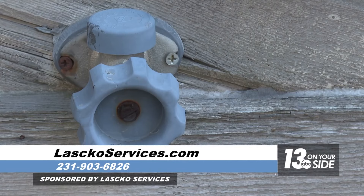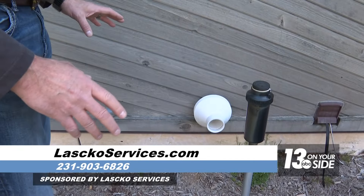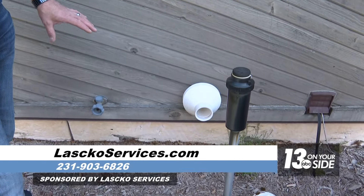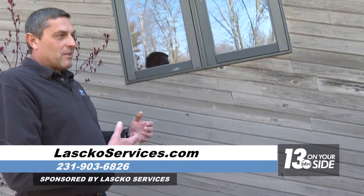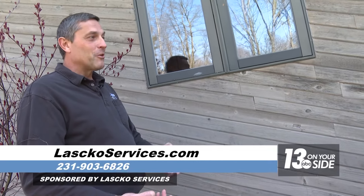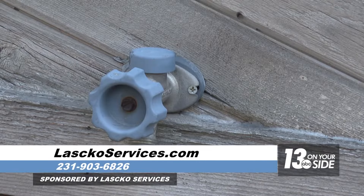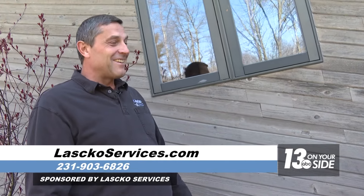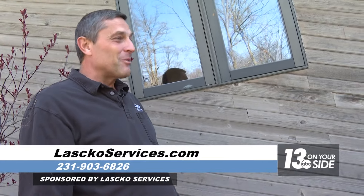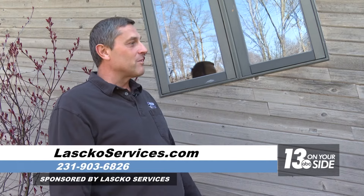The last thing is outside faucets. When you first turn one on in the spring, let it run for five to ten minutes, then go inside the house and make sure there's no water leaking, because things can break over the winter. You could be outside for hours cleaning your car and doing yard work while flooding your house. It's a real thing — people are outside having fun doing spring things and causing problems inside the house.